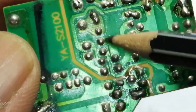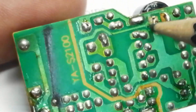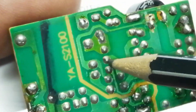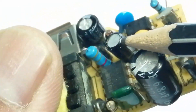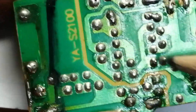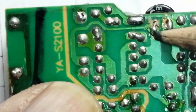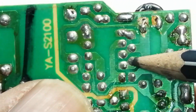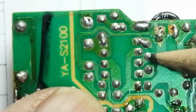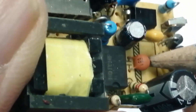Pin number six is connected here — a resistor between the negative line and pin six. This resistor is 1.2 ohm, 1 watt — the current sense resistor. Pin number three is connected to ground. Pin number four is CT — the timing capacitor, connected between ground and this point. This small timing capacitor is code 681.